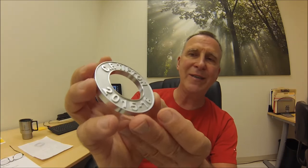So Chuck, thank you. You inspired me to get outside of my comfort zone and experiment with something that I've never done. I've never generated CNC code like this. I can do trajectories and engraving and stuff like that, but I've never done a volume milling where you take material away from something that has internal positive features. Like these letters, I don't know if you can see that or not, but they're actually raised up inside this little undercut. This is substantially thicker than the final part will be, and Chuck wants this in brass.